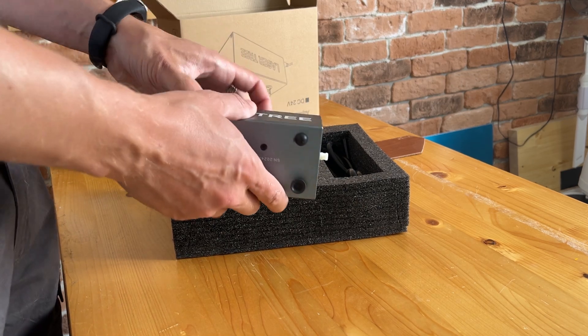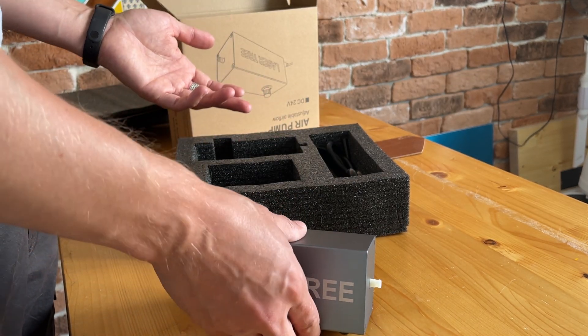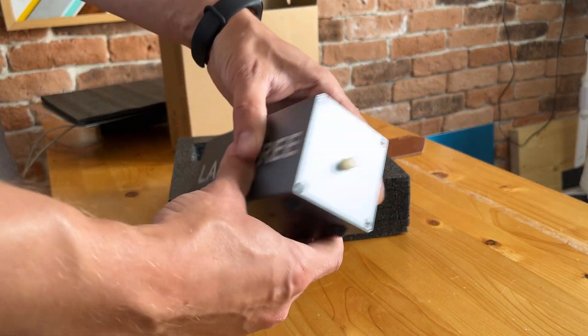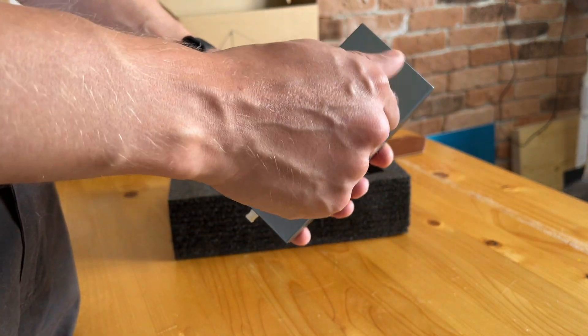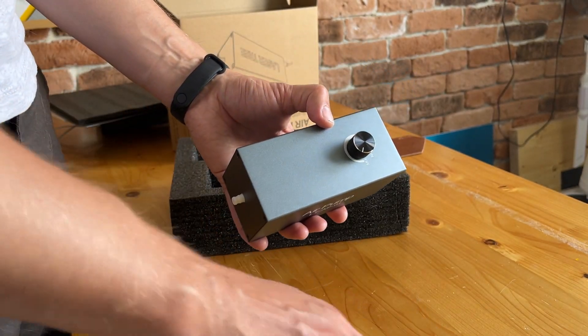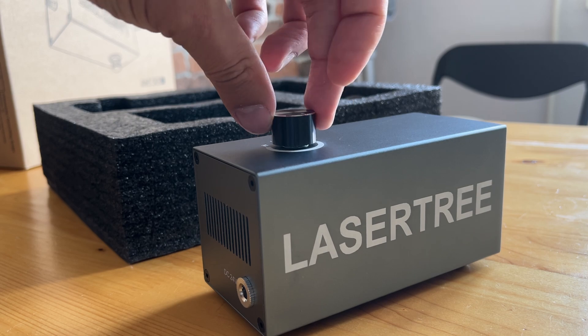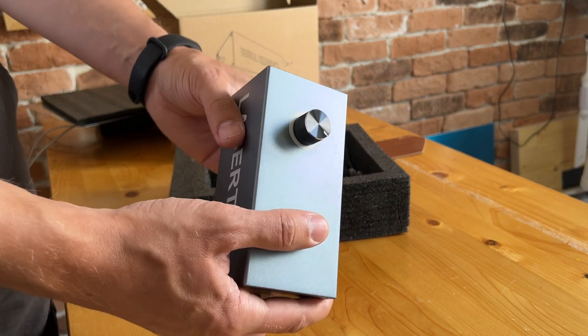The air pump is mostly needed during the engraving process. The airflow will significantly improve the operation of the laser — the laser works much more effectively on the material. There is a small pump with a flow regulator, and you can set it to a minimum level. If you want to engrave, putting it on minimum means the lens will last much longer and stay cleaner.